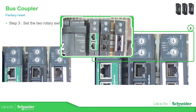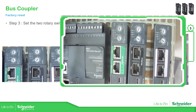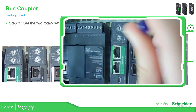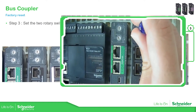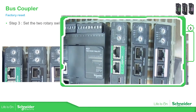The next step is to change the rotary switch position to number 8. Remember that using the Modbus serial — the one in the middle — I'm going to use a screwdriver. I'm going to move both switches to number 8. Perfect — they are all in number 8. So everything is in number 8 now.